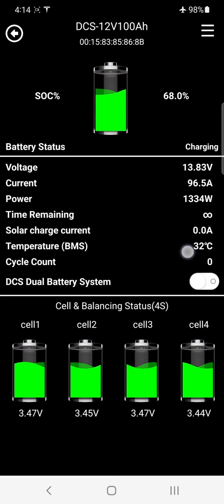The app shows the average of the three sensors, and the highest value among the three — which is typically the BMS temperature, since you can't directly control transistor heat. This shows how hard the transistors on the battery management system are running. Right now, charging at 100 amps, we're sitting at 33 degrees, and you'll see that temperature slowly climb as we charge at maximum power.